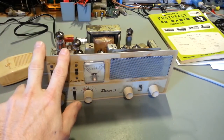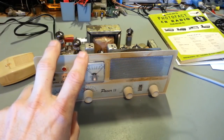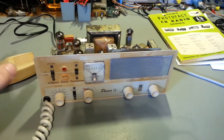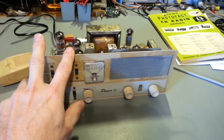Because this is an old radio, where the Tram D201 is a crystal synthesized radio, so it uses two crystals, mixes the frequencies from those two oscillator circuits together, and it depends on the radio, but it'll use either sum or difference frequencies. This radio is not like this. This is a lot older, so it has a separate transmit and a separate receive crystal.